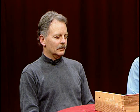What sort of joinery would you use in constructing a drawer? And talk us through some of the variables. I'm almost laughing because I've been through the whole gamut. We probably all have, but dovetail joints on a drawer aren't essential, especially if you're using mechanical drawer glides. The drawers are always going to move in and out nicely, and it's not needed for the strength.